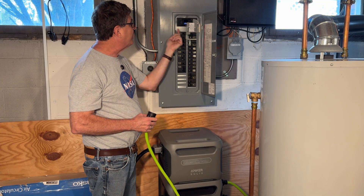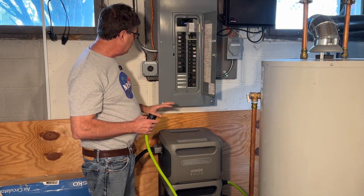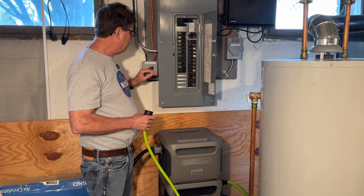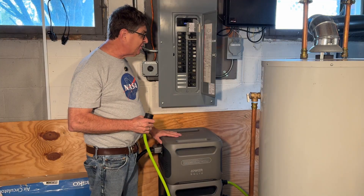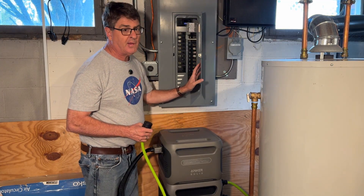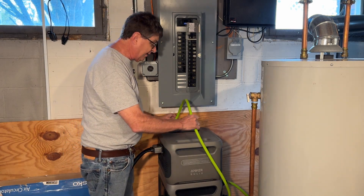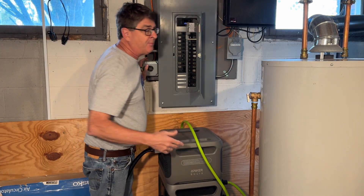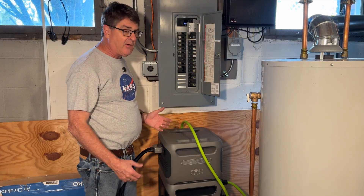Now I've got my 7,250-watt generator presented right here. This can go into the Anker for pass-through charging, and then the Anker feeds the generator inlet there and goes into the power panel. If something went horribly wrong with the Anker — for whatever reason I couldn't or didn't charge — I could go directly from here to here, and that would be just like connecting to the generator directly. There are ten ways to do this, and I just thought I'd show you how I did it.